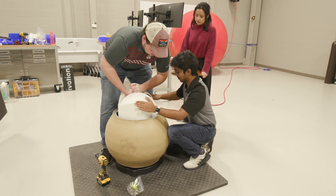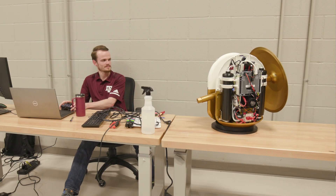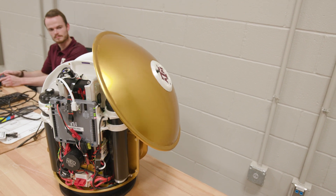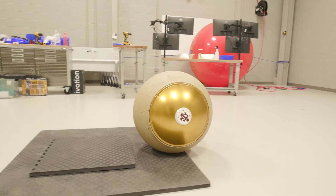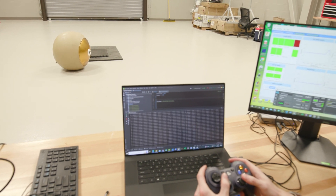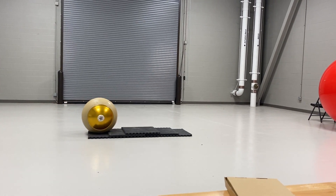You see here, one of the balls is fully skinned, then you can kind of see the pendulum — what's inside the ball — hanging on an axle. And with that axle, it's able to roll forward and backwards or steer left and right. So it's really the simplest mobility system ever, because it's really only got three moving parts: the ball and then the two axles that can rotate.